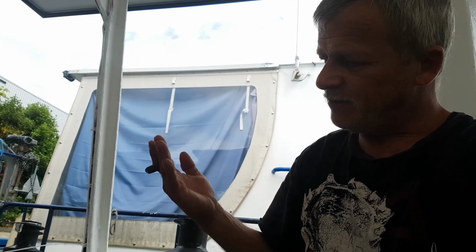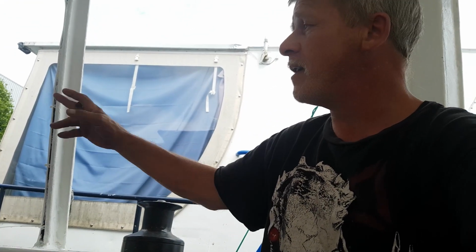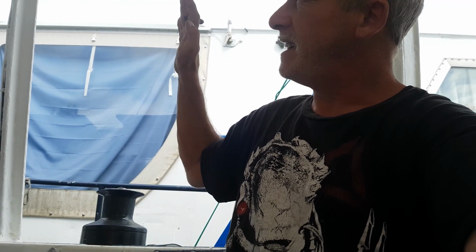The backside, at the davits, I did 7 layers, inside and outside. So around 7 layers here, 7 layers the other side. I also did strips from above and low. Where my dinghy comes on, I have a strip a little bit lower. In the middle I have one beam, and one strip over it also to the ground, which makes it stronger on both sides, because the force is hanging, so your davits want to do this. It cannot go anywhere now.